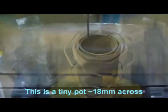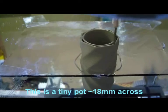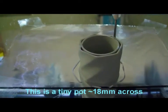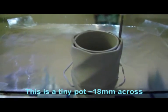There are actually some faster versions of these out there. The one he's doing here, he's trying to figure out if he can use effectively exactly the same code for a plastic printed part as for a frosting printed part. Because it's a kind of new technology, he's still experimenting with it. Little tiny parts — 18 millimeters across — so this is super high resolution. I believe the nozzle there is a 0.6 millimeter needle.